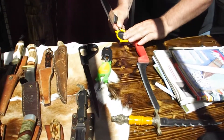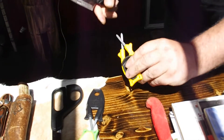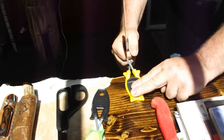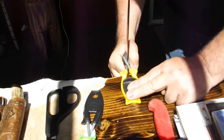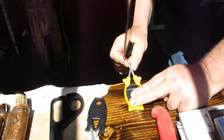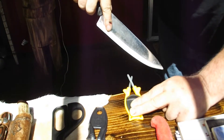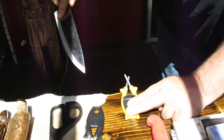Here's how they work. A simple way to use them is you put them on the edge of the table — they got little bumpers. Lock them up nice and tight, push in, make it spring, draw your blade through. The pin adjusts so it picks up on the original edge and puts the original bevel back in any size blade or any kind of blade.